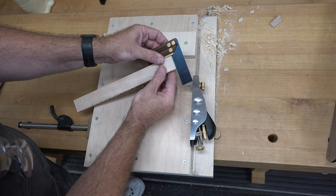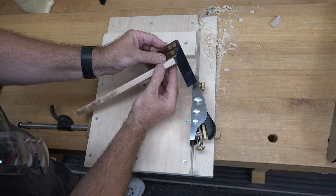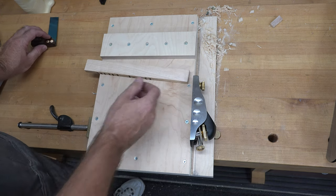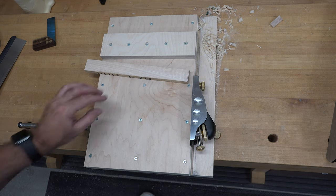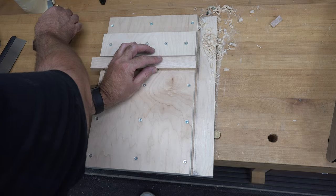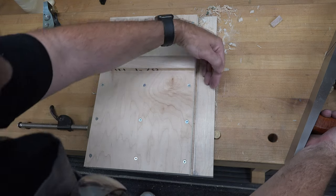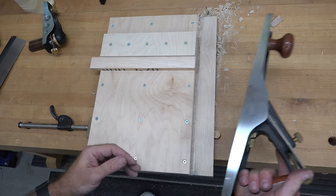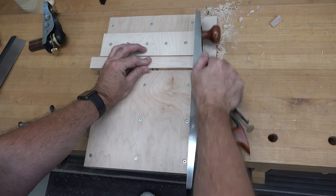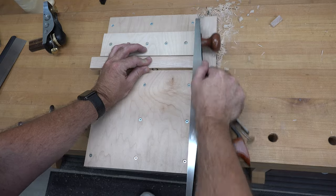And we are pretty much right on there. Not up to our line just yet, but still square. You can see that it takes just a little more effort with the block plane as it's a little short, choppy movements. And I had to keep adjusting my blade, which didn't help. But we'll bring in our four plane and bring it down to its normal dimension here.